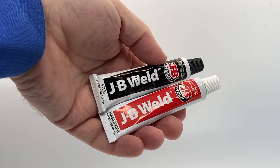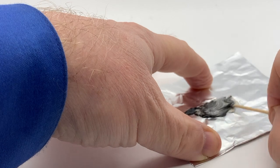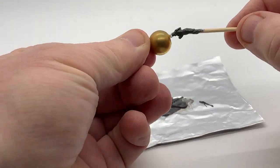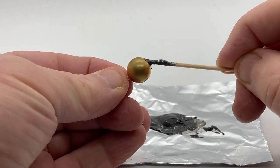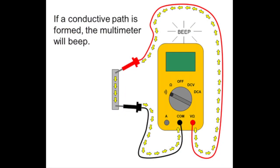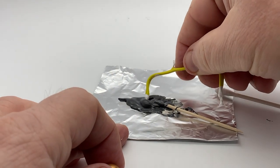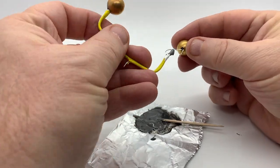You can drape the thermocouple over a roll of duct tape while this protective coating sets up. This is also a good time to prepare your heater — fold one lead tightly over the resistor and dip it into the insulator so that it's at least one-half inch below the resistor. Let everything set thoroughly. To construct the sensors, you'll need a metalized epoxy that transfers heat easily. Mix up a small dollop, pick up the ball that's been drilled completely through, and feed the leads through it, coating the resistor with epoxy as you pull it in so that the resistor just clears the lip of the ball.